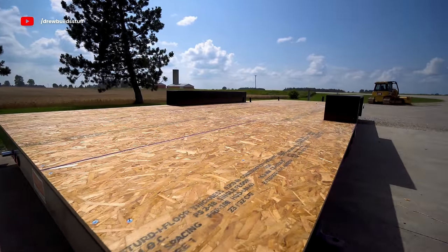You're gonna need a hand when doing this because some of these walls are maybe 300 pounds or so. I'm just temporarily screwing each wall into place using some of these self-tapping screws. And then these will get replaced out with big 1/2 inch bolts once all the walls are up. To support each section of wall, I'm driving a stake into the ground, and then I'm just using a scrap 2x4 to brace up to the wall wherever it's level.